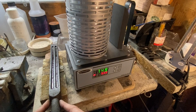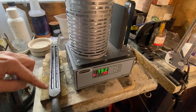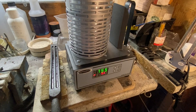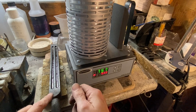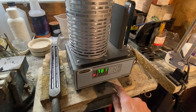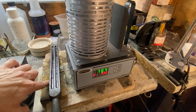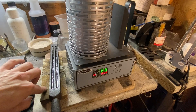At the side I've got my cast iron ingot mould, which allows me to cast two long ingots — great for putting through the rolling mill, making wire, which is what I'm going to do. They're coated in oil, so when I pour the metal into it you might see some flame and a bit of smoke — that's perfectly normal. I've put them on a soldering block, so if I get any little drips or spills over the side, it'll just go onto the soldering block. When they're cold, pick them up, recycle them and there's no damage.